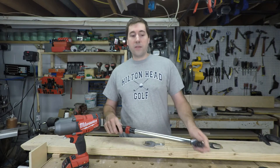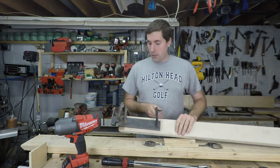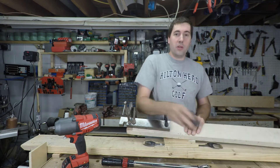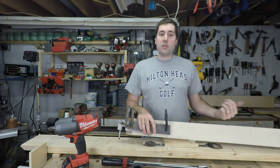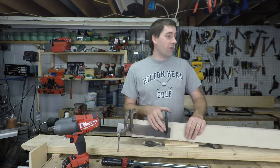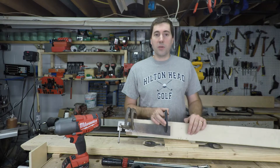So instead, what I've done here is I've built my own. What we have here is a one-inch bar of steel. There's a square on the end of it that I can put in a nice one-inch drive socket, and I've got it attached to a long 2x4. At the end of the 2x4 I can hook up a force gauge. With the force gauge there, I know how much force I'm putting on it, and since I know the distance from the bolt to that force gauge, I can figure out the torque that's going to be applied.